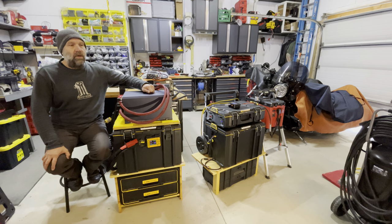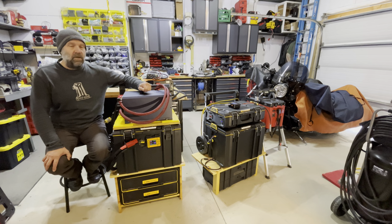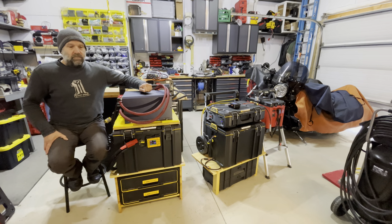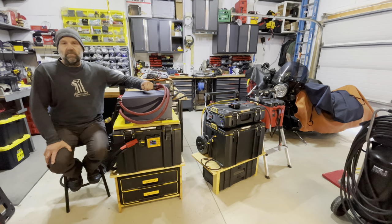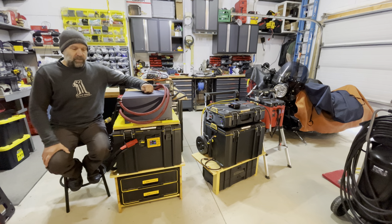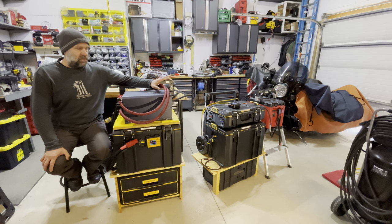When you're working with the MPPT, you'll see that 12 volt to 24 volt doubles, and doubles again at 48 volt. Those high-end boats and high-end diesel pushers are already set up for 24 volt, so hopefully this will eventually trickle down to every travel trailer and truck camper so we can start taking advantage of 24 volts — because managing hot cables is really hard otherwise.